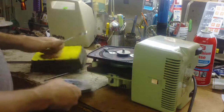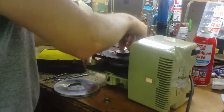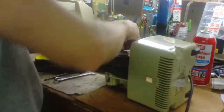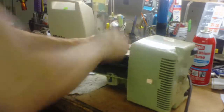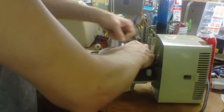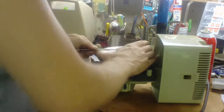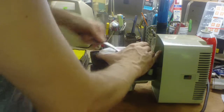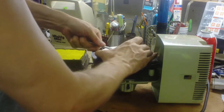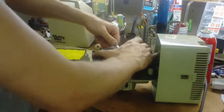This part is kind of tricky when you put it back together — there's no spindle stop. So you have to hold it still and just keep working it like this even though the spindle's turning. It'll get tighter and then really grab. To take it off, just hold this still — regular right-hand threads.